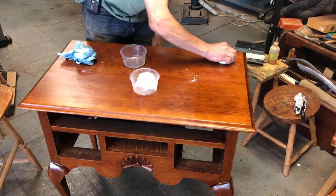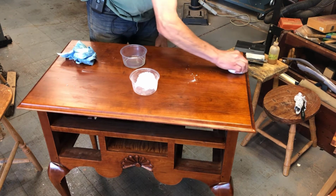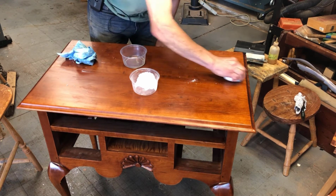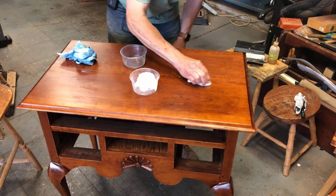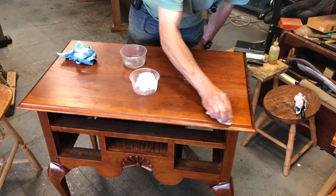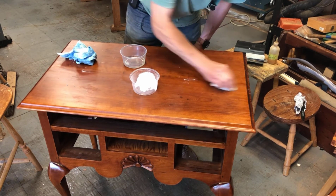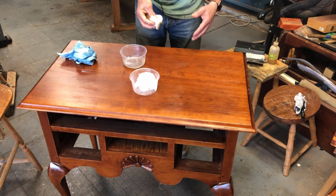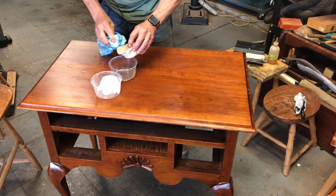I didn't do a French polish on this. I just brushed on the shellac coats, mostly seed lac, but I did brush on, or actually patted on, some de-waxed blonde shellac as a last coat, just some straight strokes. So this was just mostly brushed on shellac. Probably 10 or 15 coats.